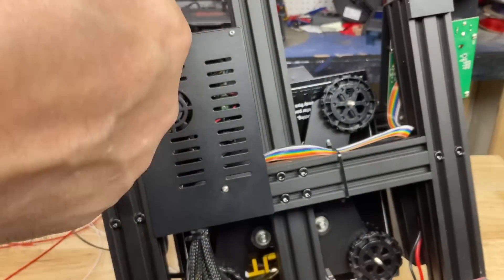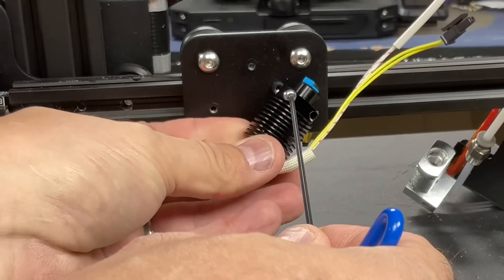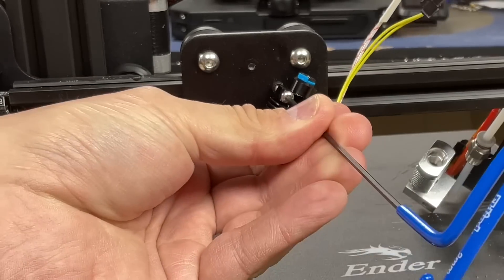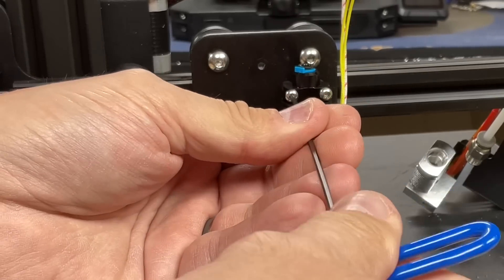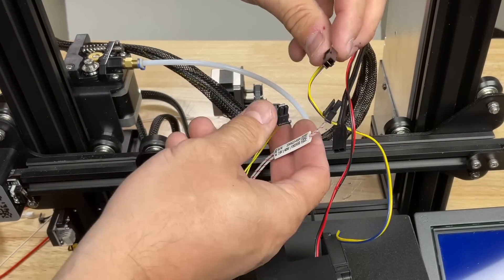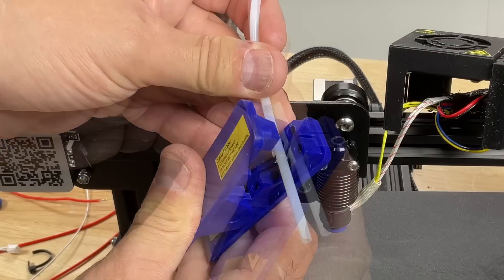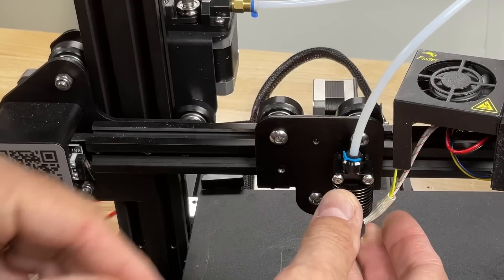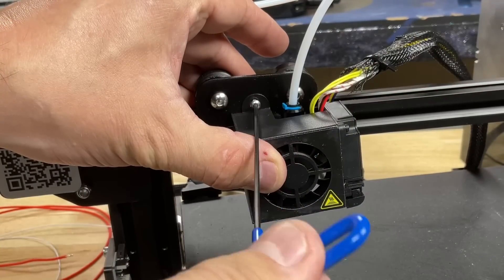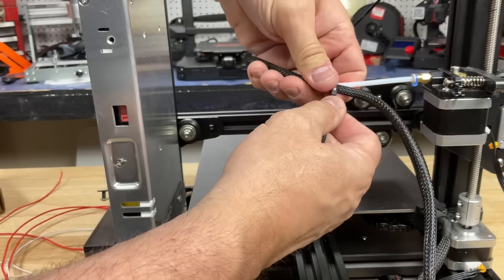I tightened the screws in reverse order, installed the two screws on top, and the cover was completely installed. Next I installed the new hotend — the two screws that held the old hotend go right through and mount perfectly to the new one. I mounted one side slightly snug, then put the other in place and tightened them both. Connect the harness to the hotend connectors: make sure the white wire goes to the thermistor and the dark wire goes to the heating element. The original PTFE tubing went all the way into the hotend, but this one doesn't need to go that deep, so I cut off the bad portion, pushed it into the new hotend, and installed the locking clip. I routed the wires to the side in the shroud and tightened the two screws to finish the assembly, then installed new tie straps to hold the wiring harness to the PTFE tubing — note that tie straps are not included in the kit.